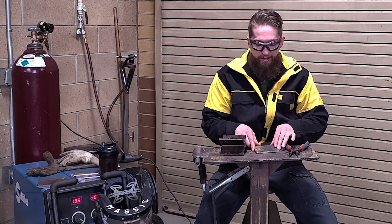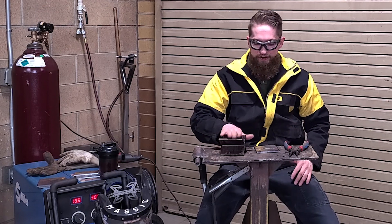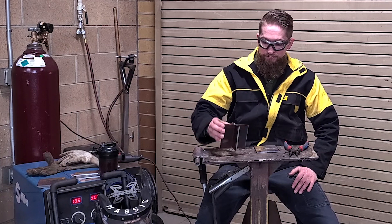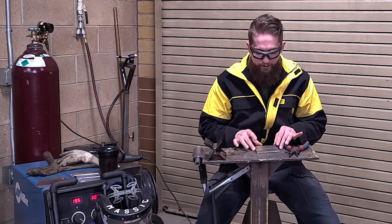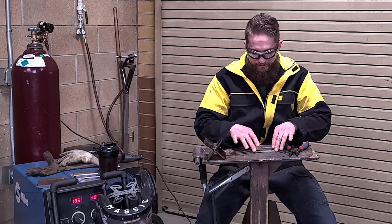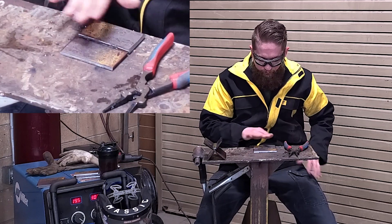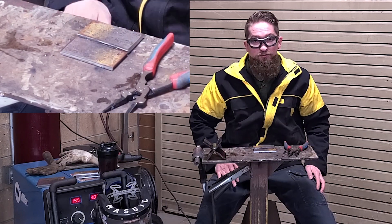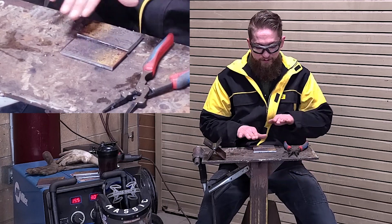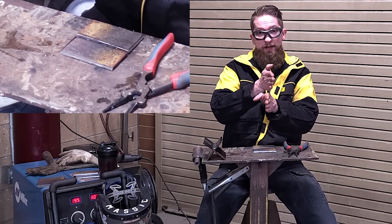We're going to tack it together down on the table flat, but when we weld it you need to tack it to another piece of scrap or something that will prop it up. I'm going to use our multi-T from the last weld — I'll set this up and tack this to it after I get it fit together. Just like our flat butt joint on gas metal arc welding, we're going to match these up and get a good fit. I'm going to put a little more than an eighth-inch gap but not quite three-sixteenths — somewhere around there. Then we'll tack each end, making sure it's flush.